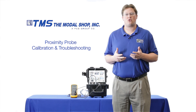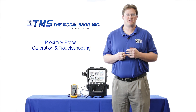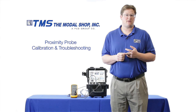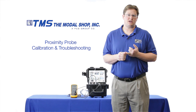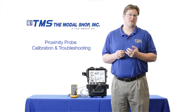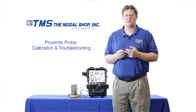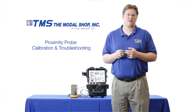You can see how the Modal Shop portable vibration calibrator can troubleshoot proximity probe cabling issues that gap voltage sometimes can't detect. Not only is it a great troubleshooting tool, it's easy to use — the proximity probe needs to be mounted only once, the exact displacement can be read on the display, and the exact speed of the machine can be simulated by changing the cycles per minute or the frequency in Hertz. It's also a very accurate product with the best accuracy in displacement of any product of its kind, and it comes with an ISO 17025 accredited calibration certificate — the only product in the industry to come with such an accreditation.